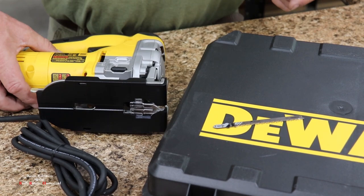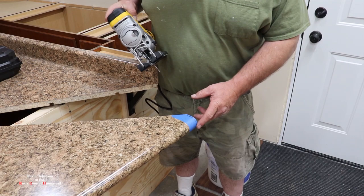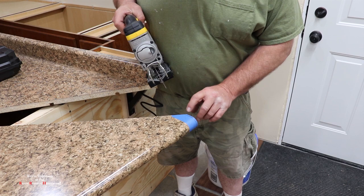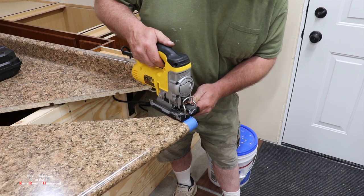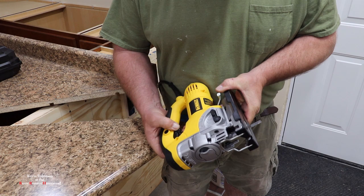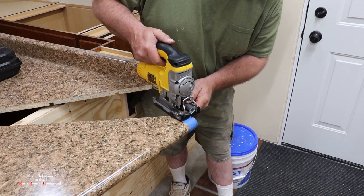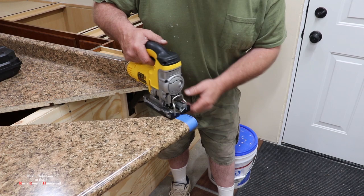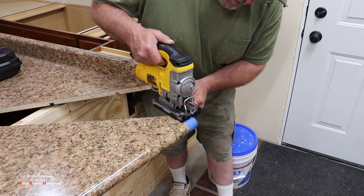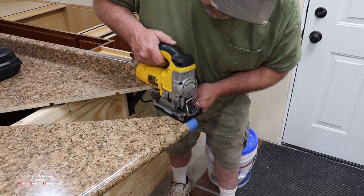We're going to give this thing a try — we're going to cut the corner of the countertop. When I ordered these countertops they were supposed to be right, but we need about a quarter of an inch off of this one. The saw also has variable speed — you can turn the trigger for faster or slower. We're just going to take our time and put it on one. We put tape on for extra protection. I don't want to go all the way down to the line; I want to take as much as I can off and then finish it with the sander. We need the dust control up high.